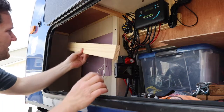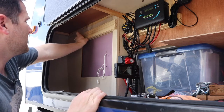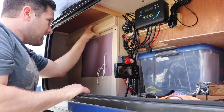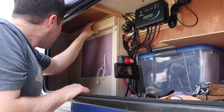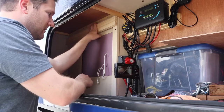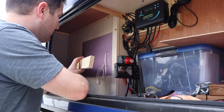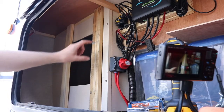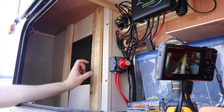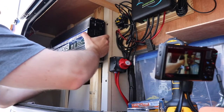I've got two pieces of wood. What I think I'm going to do is get these mounted up here so we can drill the inverter to them, and put the wiring on the top one. I've actually changed my mind on the mounting — I was going to do horizontal slats, but now I want to make sure the weight is supported on the actual floor of the travel trailer, so I'm doing vertical instead. That will hold it a lot better.